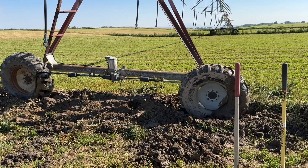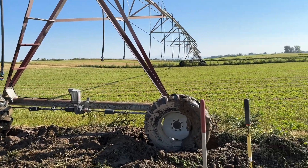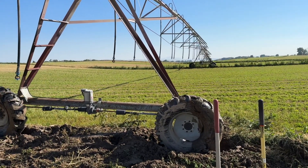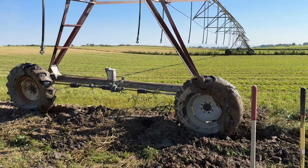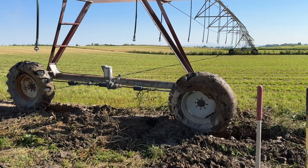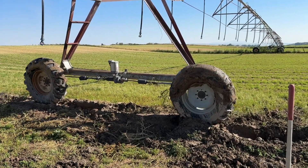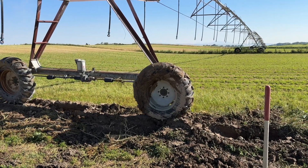All right, there it goes — it's still kind of struggling — and there it's pulling itself out of the mud. This one wasn't horrible to get unstuck. Now it probably clicked and the next one's going. The next time it goes around it's going to have to climb up those same ruts, so probably what we could try to do is get the pivot track filler and go through it so it won't have such deep ruts. Anyway, that is how you get a pivot unstuck — at least the last tower. This one was fairly simple. Thanks for watching, like and subscribe for more content — I'm going to go get a little more wet. Luckily it's about 90 degrees today. Have a good one.